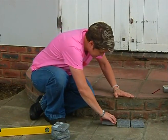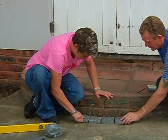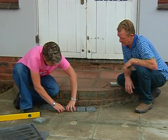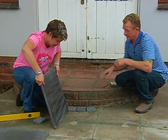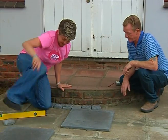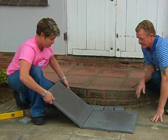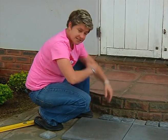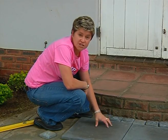So just to show you the look that we're going for, it's going to look something like this. We're going to have the cobble going all the way around here as an edging. And then from that, we are going to start, and notice, here's my line. We are then going to be taking the smart tile, one on that side, because this is our center axis, and one over here. Now, that's the basis. From these two guys, everything happens. You go out that way and you go out this way, because we're going to make sure that these two are just in the right spot.